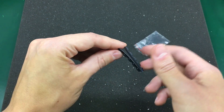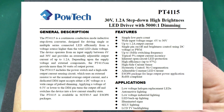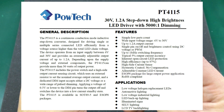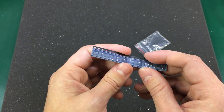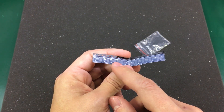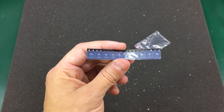The last item from today's episode: some PT-4115 ICs. This IC is basically a DC to DC step-down converter designed to drive single or multiple LEDs in series. It works with an input voltage between 6 and 30 volts and can output up to 1.2 amps. What makes it interesting is that it limits the output current using an external shunt resistor in series with the LED string. It also has a dim pin which can accept either a DC voltage or a pulse input to control the brightness of the LED string. They're cheap and can easily drive LEDs when needed.